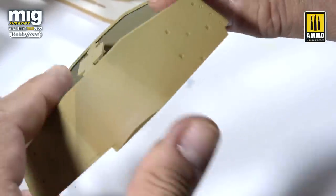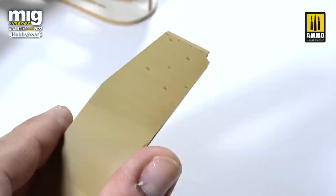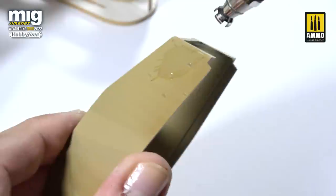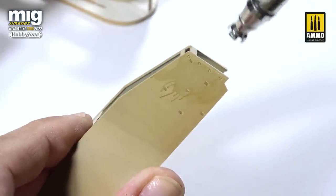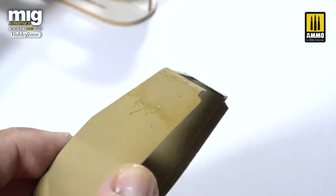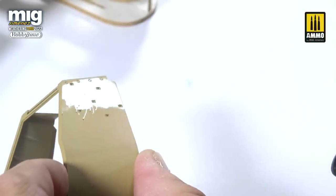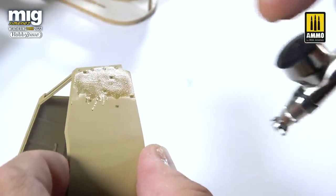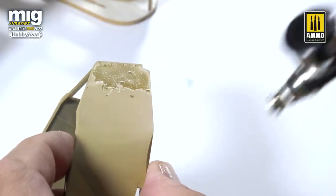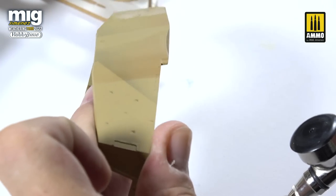Let me show you what happens if I overflow it, like when you are using lacquer varnish, okay? With lacquer varnish, people are used to overflowing, like this. They do something like that. Okay, let me catch, here. Maybe you will find some customer telling you, hey, this happened to me, because this is not the way. Yes, too much. It must always be very smooth layers, letting it dry all the time, and you will see how the result is amazing, very smooth and perfect.